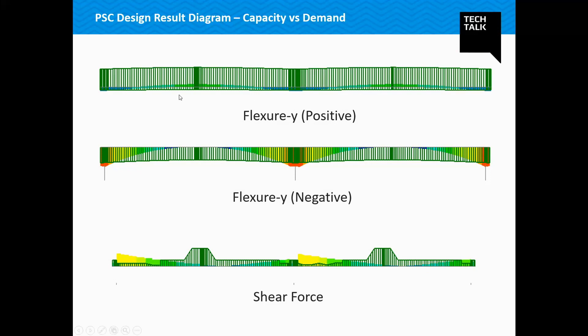The diagram appears showing that for positive flexure, the green line represents the capacity and the other lines represent the demand. We can see that at the joint locations, some of my girders have more moment than the capacity of the girder, so those elements at those locations will have to be redesigned. Similarly, the PSC result diagram for shear has been checked — some materials are quite safe in shear, while some are failing. We can refer to these diagrams to identify which elements need redesign.